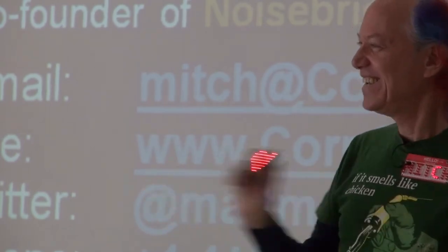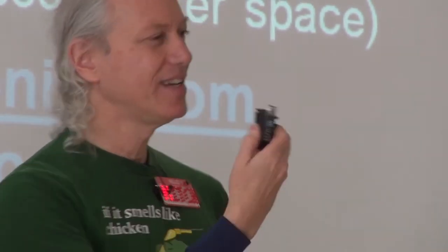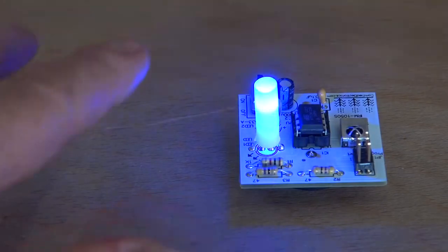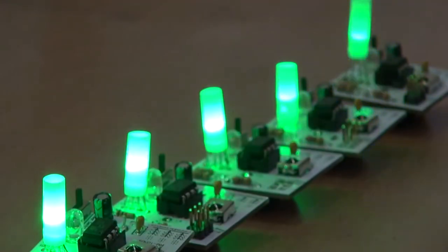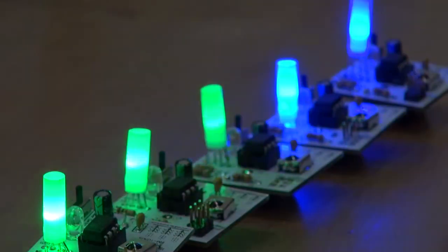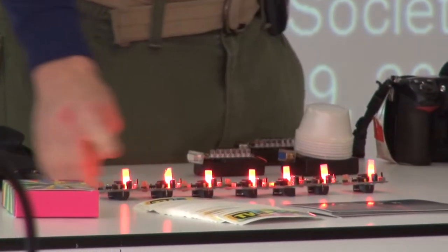It's a message I like. This is an infrared LED — the exact same ones that are in TV Be Gone and TV Be Gone Kit. They shine infrared light, and the light is aimed this way out of the board. If you put your hand in front of it, the infrared bounces off your hand and hits the board and hits this infrared detector. And every time you wave your hand over, it goes red, green, blue, and then lots of other colors. You can interact and get waves of colors.